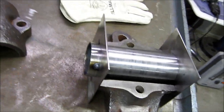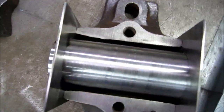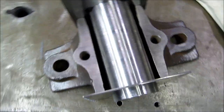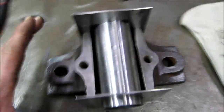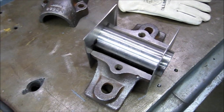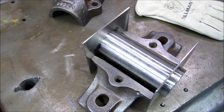This is the one we tacked so we know it's square. The reason we want it square is so that this track goes through the center of the casting and we'll be able to judge our side-to-side distance. Then we're going to go ahead and put a pair of clamps, clamping it this way. Now it looks like we're ready to start getting our Babbitt pot ready and get ready to pour.